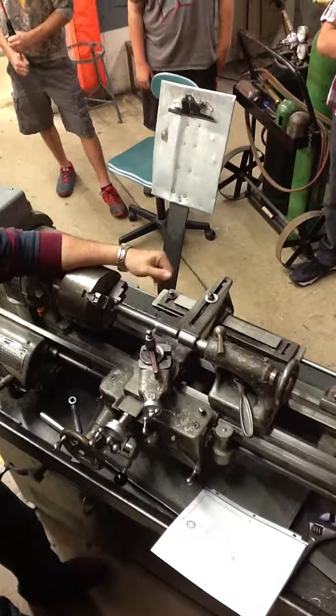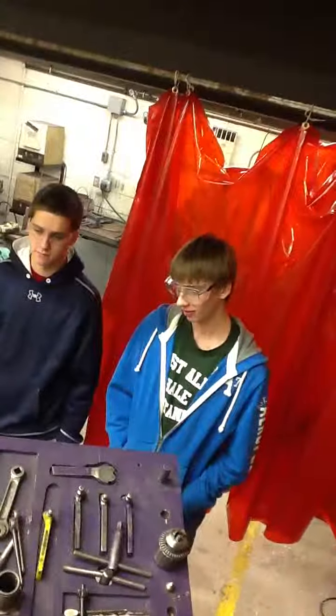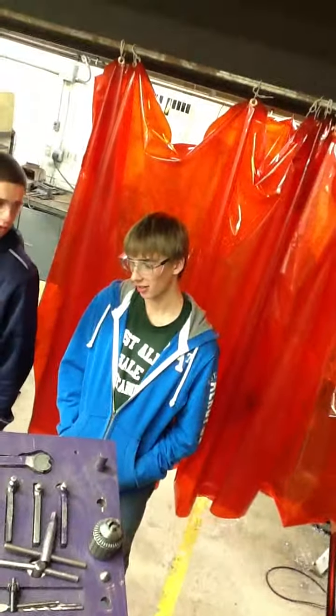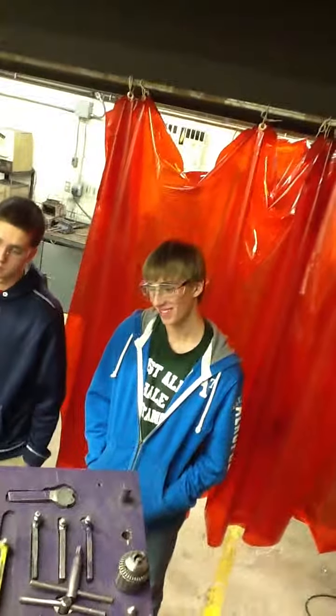Anybody have any questions? Yes? What did you mark on the side over, like how far? A ½ inch. So the distance between the end of my jaw stick here is a ½ inch. And then what we have then is a 1/4 20 screw in here, and this is butted up against the 1/4 20 screw. So that allows me to flip this back and forth so I can do my cutting on either end of this and not have a big issue.